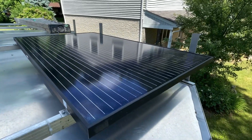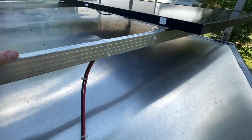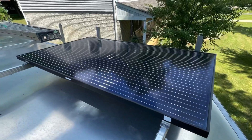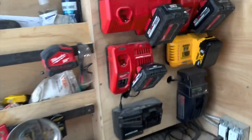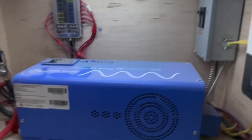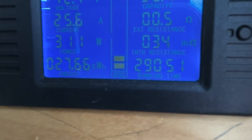The solar panel has far exceeded my expectations. It's 330 watts — I think the max peak I've seen is around 260 watts. It's flat; I don't tilt it at all. I used 2-gauge cabling from the battery bank. Get your fuses — I'll link everything in the description. The remote switch for my Aims inverter was totally worth it; I can just flip it on and off as needed.